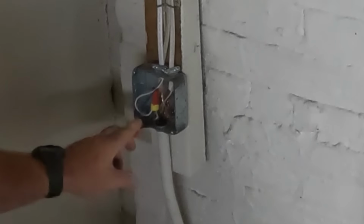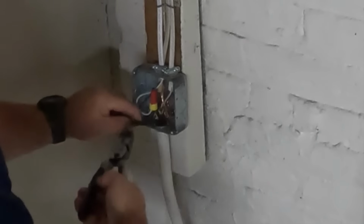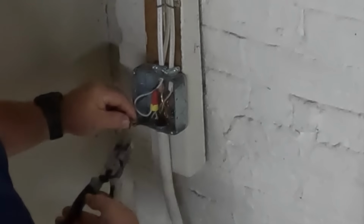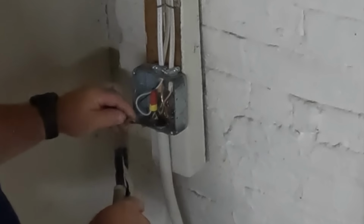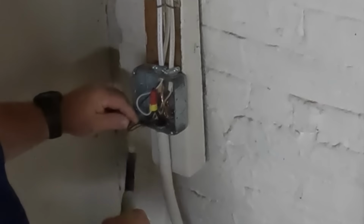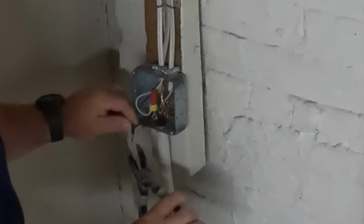Okay, so all I'm looking to do here is just disconnect the conductor that's going through that conduit at the bottom of the box. That's what's actually feeding through the foundation underneath the driveway and then outside to the garage. And so I don't exactly see where it comes into the garage because it's all boarded up, but obviously it goes underneath, and the wiring was intact.